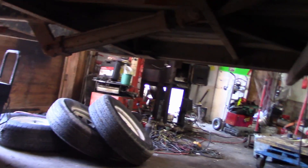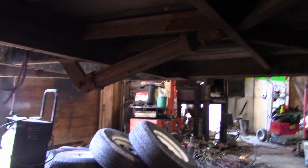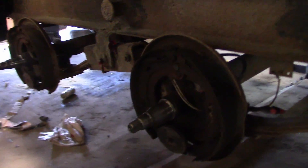The bottom of the trailer is getting beat up with rust. I want to look at that cylinder — it's not a full hydraulic cylinder, just a slow-open slow-close cushion cylinder. I greased this side already — greasing the leaves here — though these aren't greasable. We'll grease the pin in the back, which is also not greasable. The leaves on this side are worn quite a bit but move freely. It's just that one that doesn't move freely, so I'm going to look for parts.